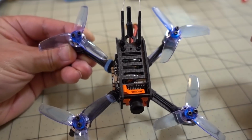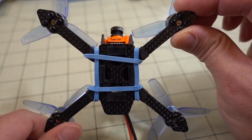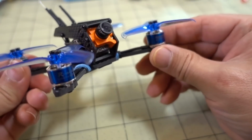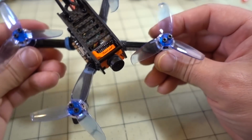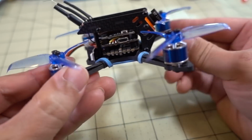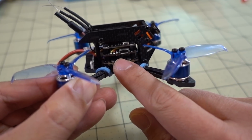Anyway, as I mentioned, it's a 2.5-inch frame, 110 millimeters motor to motor. It's a true X frame, 3 millimeter bottom plate, a little bit skinnier arms than on the mini flight. Same motors, 1106 5500 KV Sunnysky motors, and the same props, the Gemfan Flash 2540s. Comes with a three stack system here, 20 amp 4-in-1 BLHeli_S ESC, DShot600 is the default.